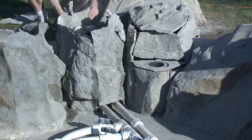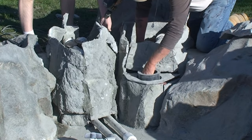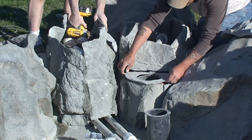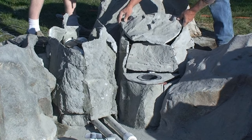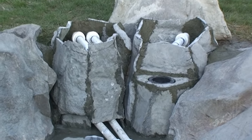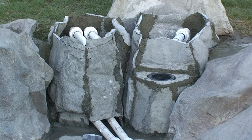In this clip, we have started to cut and wire together the panels to form the two cover rocks to hide the plumbing. The top panels of the cover rock are not yet wired or fixed to the panel assembly, as we will first mud the panel seams from inside the rock so as not to cover the outside molded texture that the panels have — the seam is wide and long and we don't want to cover up the natural textured elements. The following day, we take the rock out of the pond, attach the top cover rocks for the skimmer canister and the top of the rock, and mud that from inside again so as not to cover the molded texture from the outside.